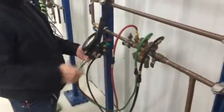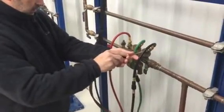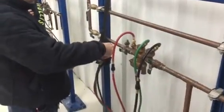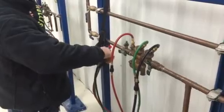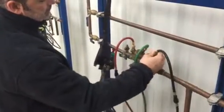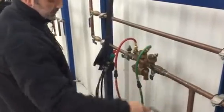Shut off test cock 4. The other 4, there you go. And then shut off the vent on the gauge. And then pull the vent hose. That's the same as the other, using a 5 valve. Now you're ready to reestablish your first check differential.